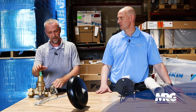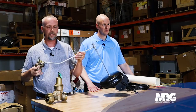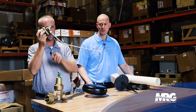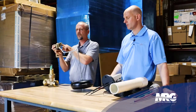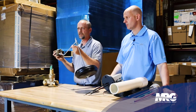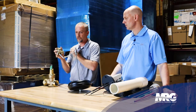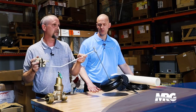The reason that's so important is this makeup water valve. Everybody probably recognizes this plunger style — if you've opened the top of your toilet, you've seen something just like this. Here's my makeup water line coming in; here's my float. As that water level drops, that goes down, it opens this valve, and whatever pressure is coming from this pressure regulator is now coming out of this valve. Problem is this will only handle 45 PSI water pressure. If it's above that, this is going to leak by. You're never going to know it until you get your water bill. This float may be up and doesn't need water, but because the water pressure is too high, it's bypassing — it just continues to leak water.